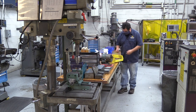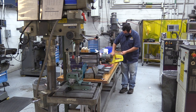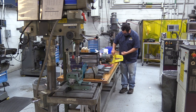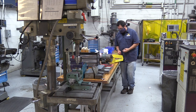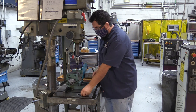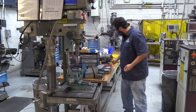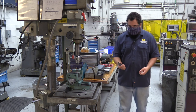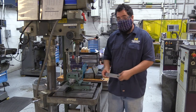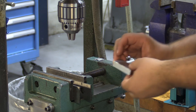We're on to the drill press. I have my part that's measured, marked, and center-punched. I'll grab a number two center drill and a number 21 for tapping. When setting up material there are a couple of ways — one is with parallels. Parallels are precision-ground pieces of metal that are parallel to each other; when placed in the vise they sit flat, which is fantastic.